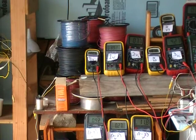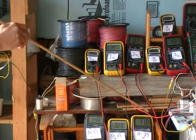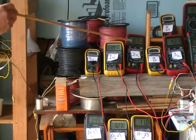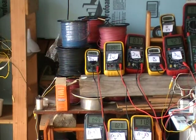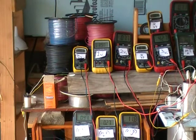Now we have a sort of new circuit mode of operation that exhibits itself under these conditions. Formerly we had voltage rises on 1-2 and 2-3 of 8 volts apiece. This is shifted to a stronger voltage. The whole system is shifted to a more 180 phase relationship, leaving the remaining 1-3 and 1-2 voltages at a minimal value. So we have one strong point of interphasal voltage in this system as it is acting now.